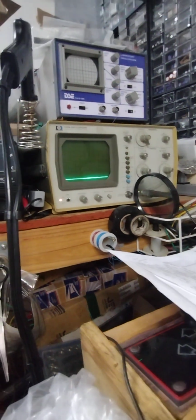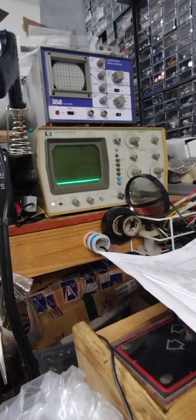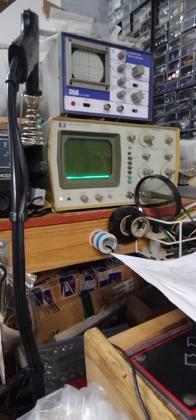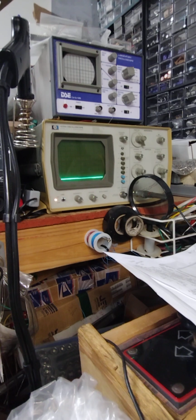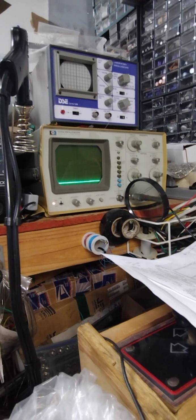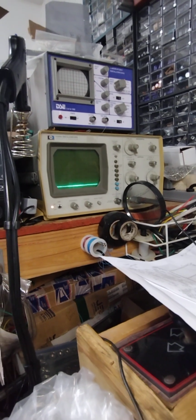So, as it heats up, of course, the warmer the temperature, ambient temperature, the faster this happens. But this scope is needing a repair, and I believe it's a minor repair. It needs capacitors, I believe, in the power supply. Like 10 different capacitors needs to be replaced.